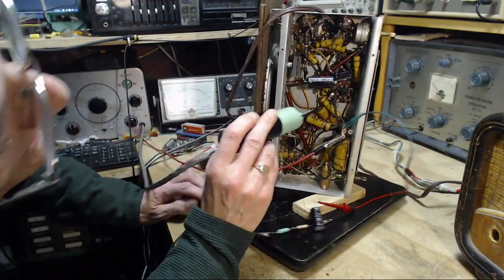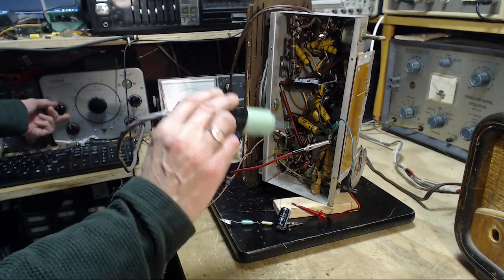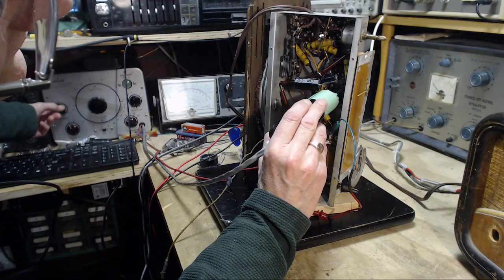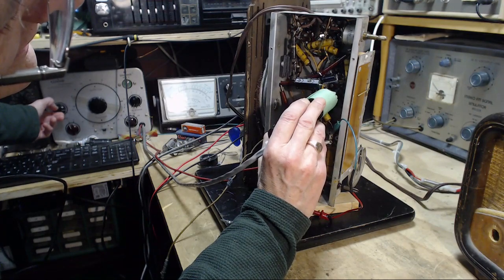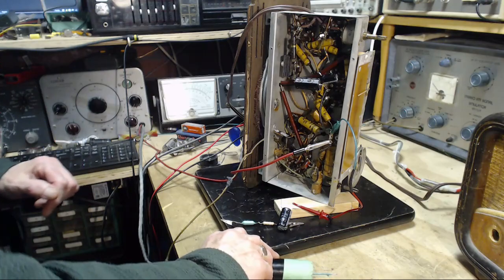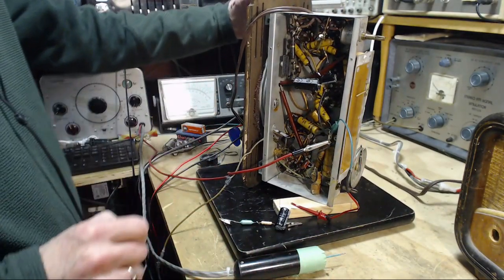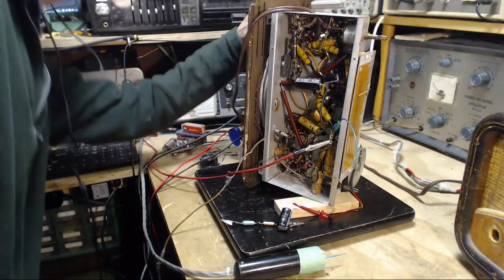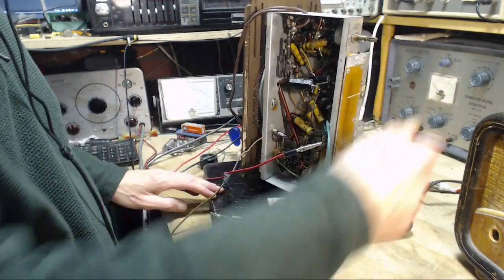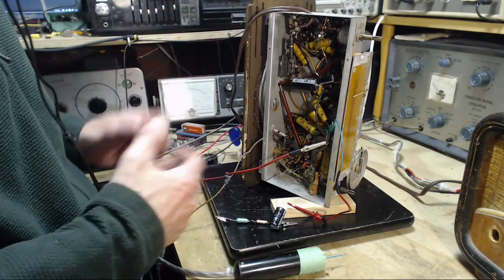Okay, follow the signal further along from the volume control. So this is the other side of the blocking capacitor coming off the volume control slider. Well, that gives me the impression, hey, come on, Jim. This thing has a phono switch. Switch the phono switch. Is that it? Feels like it only went halfway. Hum definitely there. Volume having no effect. So I've cut off the radio from the amplifier. Clearly it's the amplifier. The amplifier can produce this hum without the aid of the radio.